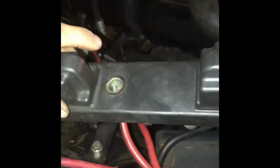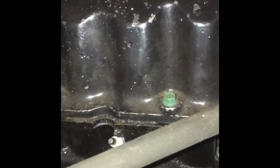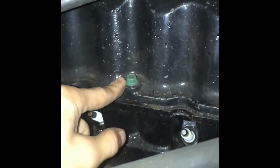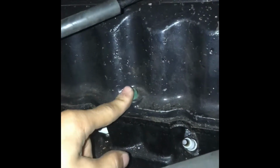So I'm going to mount this here. Cut this in more shorter, and then put a bolt. Have a piece of metal coming up like that, and going attaching to these bolts here. So yeah, that's kind of what I'm thinking. I'm going to make a cardboard template first, then cut out of 20 gauge sheet metal. So yeah, sweet.